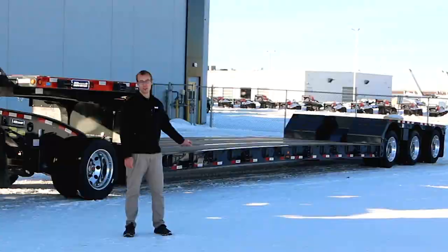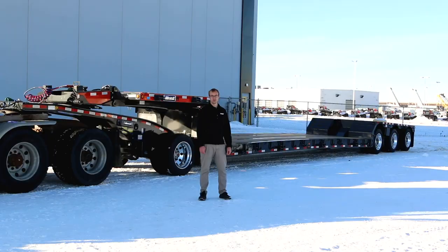The paint process Brandt uses on these trailers is also industry-leading. We start with a bare trailer frame that gets sandblasted, followed by a powder paint primer and then a powder topcoat that's going to make it longer lasting than anyone else in the industry. This powder coat will keep it looking like new for years and increase resale value when you're ready to upgrade to a new Brandt product.